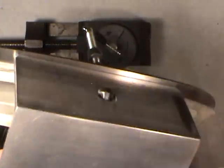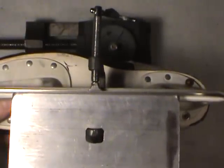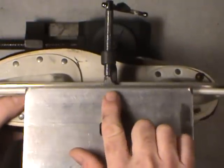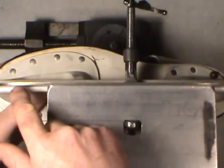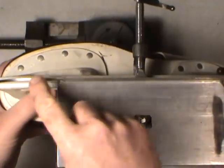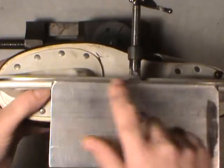So there's the clamping mechanism, and this is where I was mentioning bent blades, and this is how I discovered how bent blades are. I'll check this blade with a straight edge before I even clamp it in there, and there's really no blade that's that perfect. They'll have a bit of an arc in them, okay? So when I put it in here I won't put it so the blade is arced up, otherwise it'll just pivot on this point. In the skate, when you sharpen it, the edges won't be straight all along. You'll have a low edge, high edge, low edge kind of thing, and opposite for the other edge on the skate blade. So when I mount it in this angle iron fixture, I always find out where the bow in the blade is, and I mount it this way, so that when I clamp down the middle, it's taking the high point, squishing it down, and it gives me a little extra friction and straightens the blade as I clamp it.